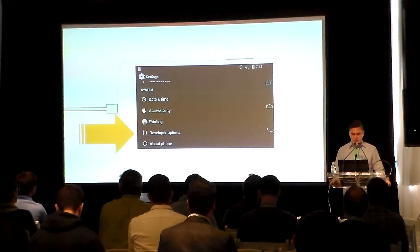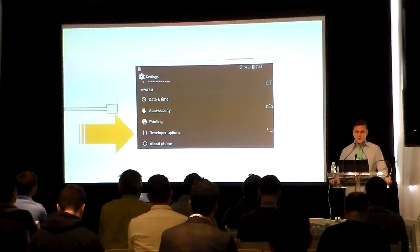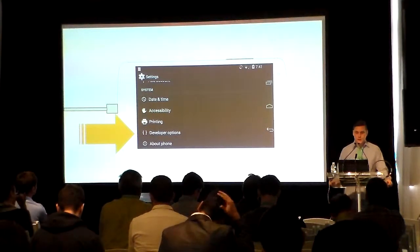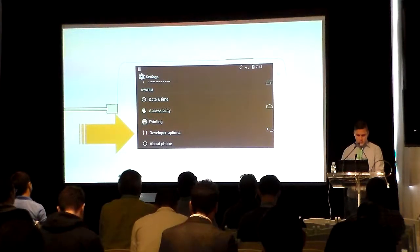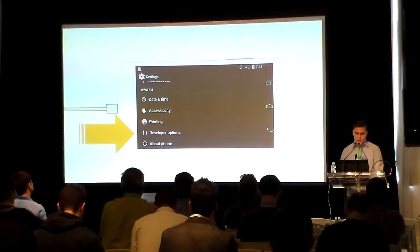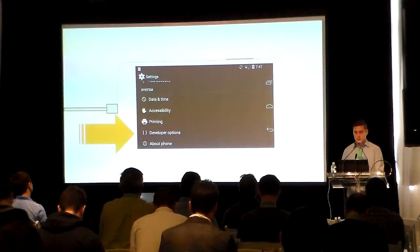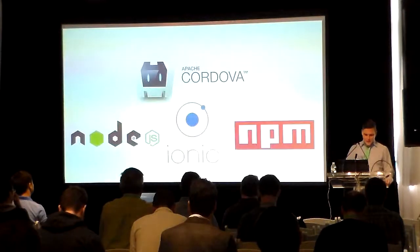Since the majority of us already have the JDK installed, we can move on to the Android SDK setup. After downloading and installing the SDK on your machine, the ADB command line tool should become available. Installing the Android SDK should give us that. The adb logcat command gives us real-time log output as we run our app on our Android device. Please note, this will require turning on developer options on your Android device under settings and making sure USB debugging is checked. I assume we've got that covered, so I'm going to skip that.